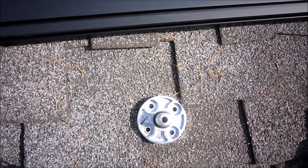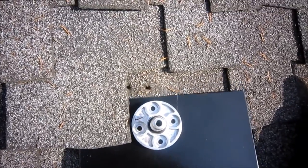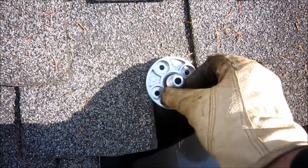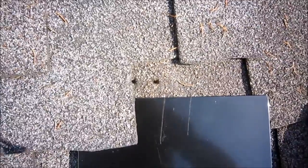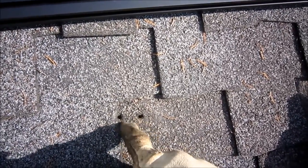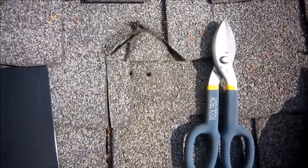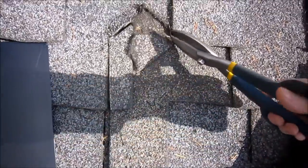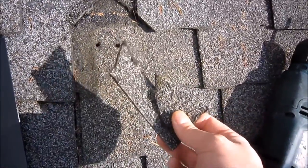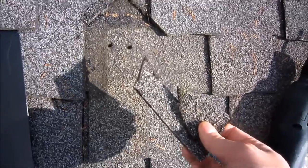This guy is going to come in here, and once it's in place the flashing is going to come and tuck underneath the shingle and go on top of the metal. I need to first clear out enough room to land this footing, so I'm going to cut it out with a pair of shears and then dig my flashing under there to make sure it's got room to slide all the way underneath those shingles. Be careful on your roof — don't leave cut shingle pieces lying around where you're going to step. They're very slippery if you put your foot on them. You also want fall protection to make sure you're not coming right off your roof.